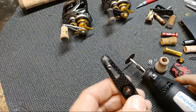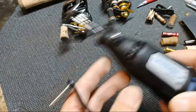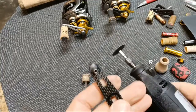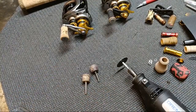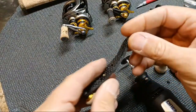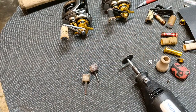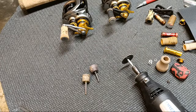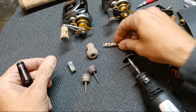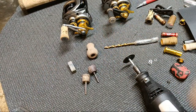I'm going to use this sandpaper for final touches. You'll need a Dremel tool — I've got a very inexpensive one, just two speed, low and high. You really only need this and a little bit of sandpaper: maybe a rougher sheet to smooth down from what the cutoff wheel does, and then a final pass. You don't need to go through 50 million different grits of sandpaper. For the knob shaping, you'll need something to cut it down — we're basically turning the Dremel into a lathe and cutting by hand.